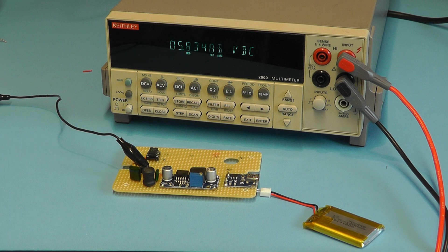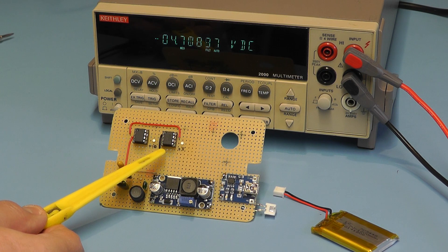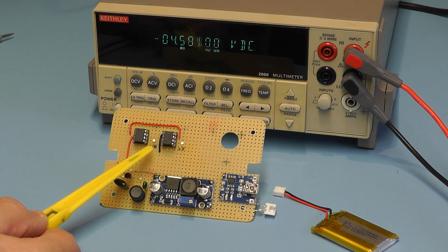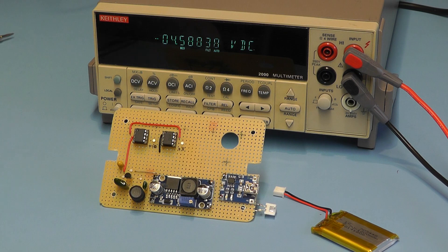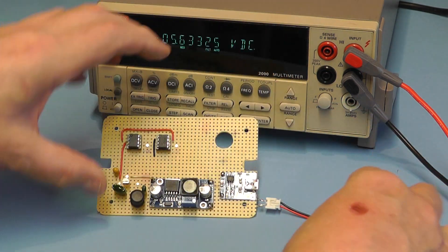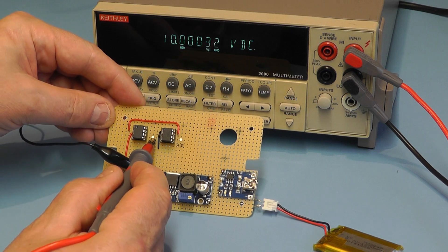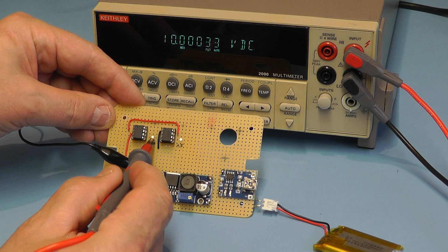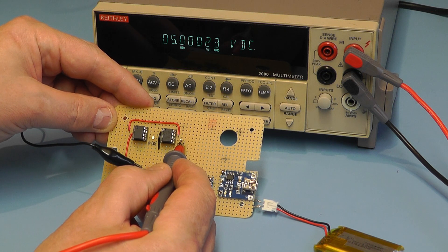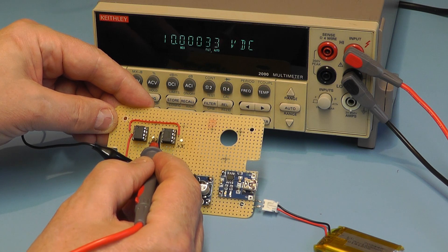Let's move on and put the other IC in and divide that down to 5 volts. I've now connected the second IC, the INA105 - all wired up underneath - and we should now be getting plus 5 volts from its output. Connecting the battery and checking the 10 volt reference: 10.00033 volts. And checking the 5 volt reference: 5.00023 volts. That is without any trimming whatsoever, so it is certainly accurate to the third decimal place on both voltages.